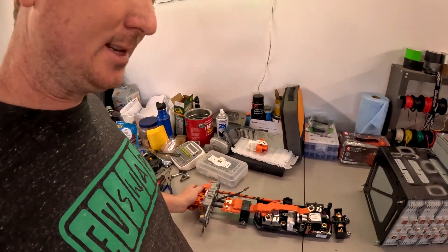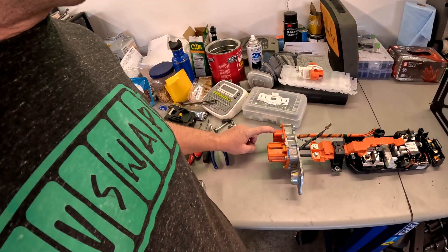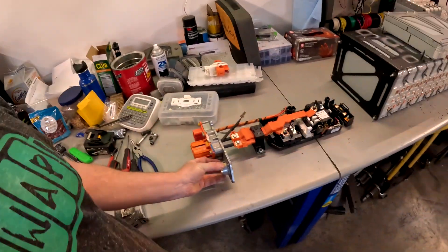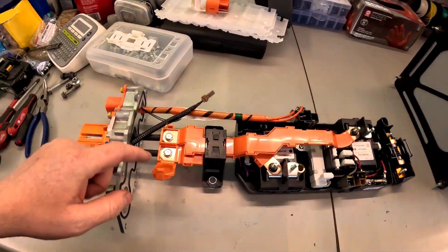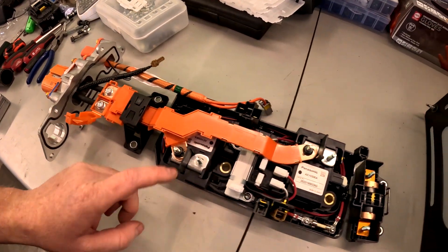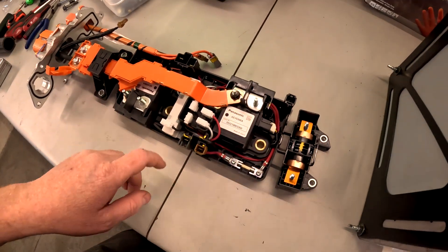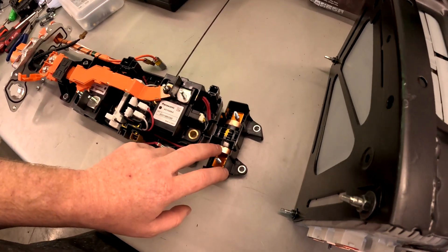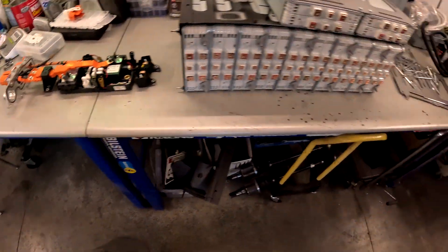This is the contactors and the connector for the main high-voltage battery, the connector for the high-voltage heater, and this round plug holds the BMS — all the CAN bus and other smaller wires. For the main high voltage you have your positive and negative contactors, a pre-charge relay, a smaller activation relay, and the high-voltage fuse for the whole vehicle.